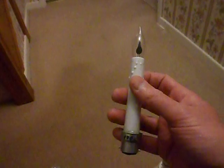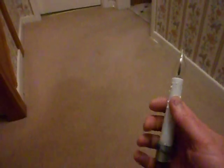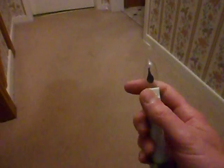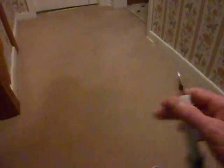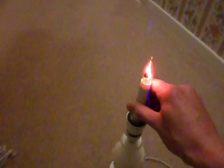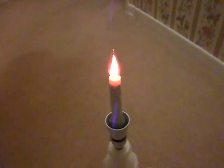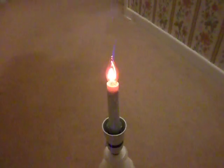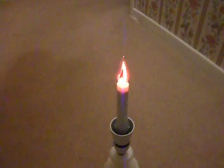This is a Bayonet cap holder — a candle bridge type neon flicker flame lamp that I have modified. I've put a Bayonet cap lamp holder on the bottom, which is the type of lamp holder we use in the UK. I've also added a 100 nanofarad capacitor inside, because in the UK these lamps get very hot in the base — the resistor used to limit current tends to burn out. By adding the 100 nanofarad capacitor, it still lights plenty bright but reduces the dissipation greatly. There's also a 1 megohm resistor across that capacitor just to discharge it so you don't get a little nip off the base.